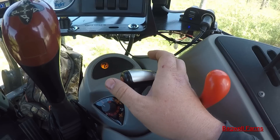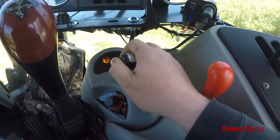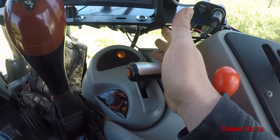To change the gear, you pull this D-clutch button down, or you can just use your foot pedal clutch. You hold it in and push forward and it'll change gears just like that — it went from second to third. It has four lights here: one, two, three, four — those are your four gears.